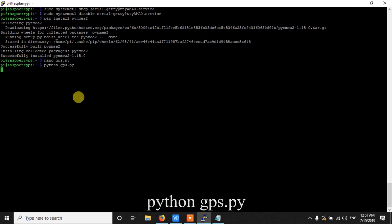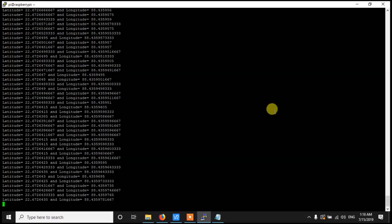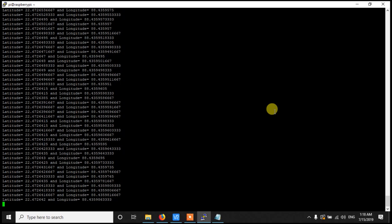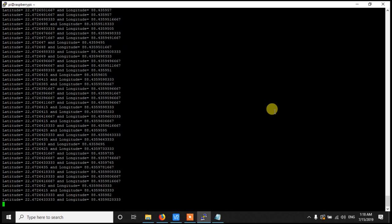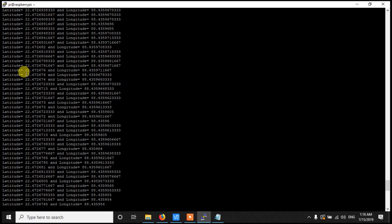As you can see, we are getting the data — latitude is this value and longitude is this value. The GPS sensor is giving us lots of data continuously and it won't stop until you press Ctrl+C. The latitude and longitude aren't changing because I'm not moving the device, but if you move it you will see them change. In this video we learned how to connect a Raspberry Pi with a Neo6M GPS sensor, set up the system, and write Python code to get the data. In the next video we will make a live GPS tracker. Please subscribe to our channel and thank you for watching.